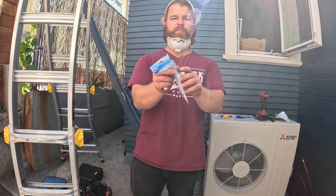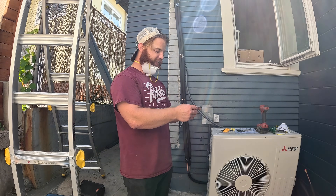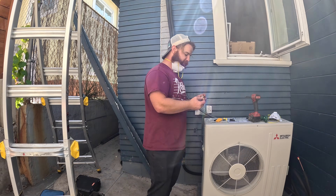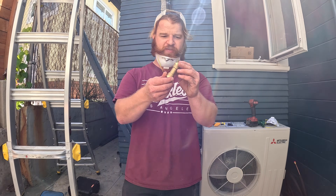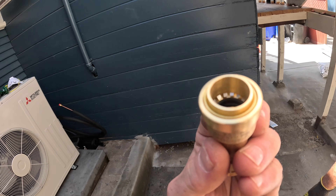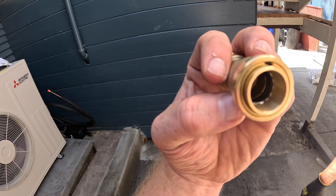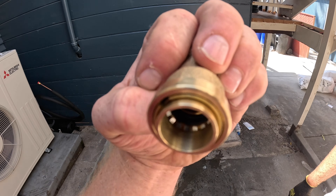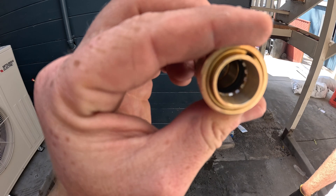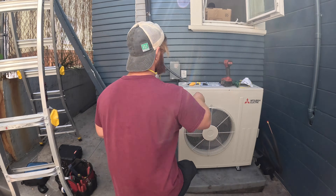Retro Seal Pro Fit quick connect fittings — these are push-to-connect refrigerant joints that require no brazing. They're probably about the most simple thing you could use. On the inside they've got little teeth that grip the pipe, and there are gaskets in there. You jam the pipe up in there and it creates a seal.